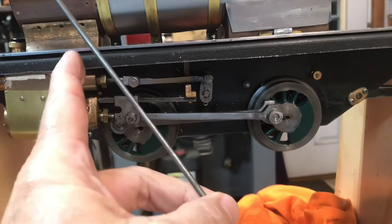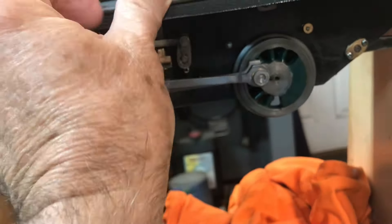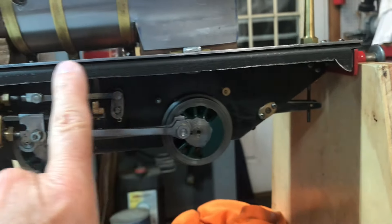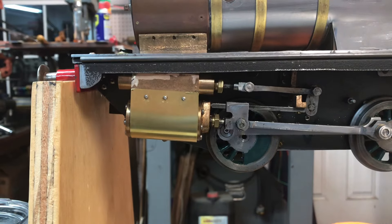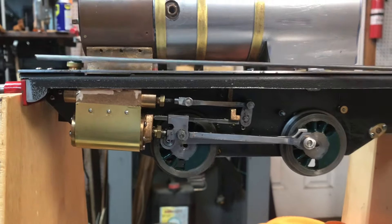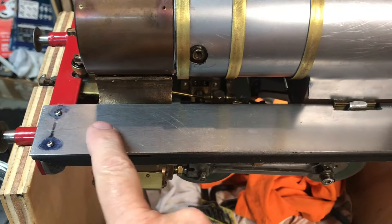Change of heart here — I decided I was thinking about putting little brass rods in and soldering them, but I realized I don't have any brass rods that are long enough; it needs to be over 13 inches and everything I have is 12 inches. It would have covered the distance between this part of the valence and the other one, which would have looked kind of odd and would be a waste of brass rods. So I have a bunch of eighth inch steel rod that is long enough, and that's what I'm going to do. When I take it all apart, I'll soft solder in the eighth inch steel round rod and just round off the edges. Now is the time to take everything apart, clean up the insides, and put solder on both sides here on the inside and then join them together.